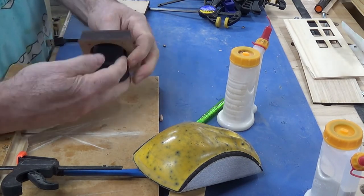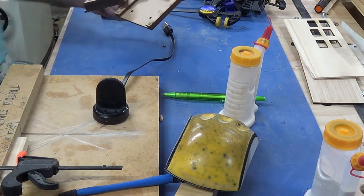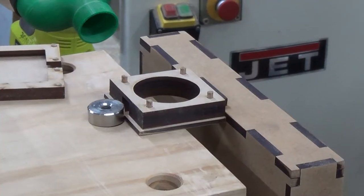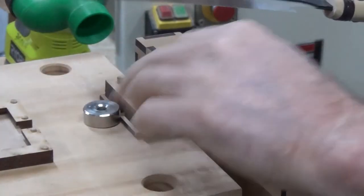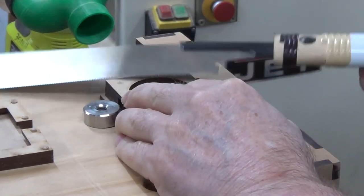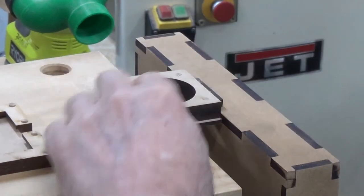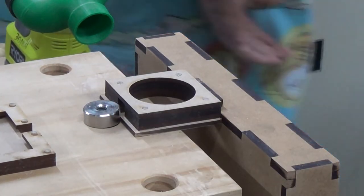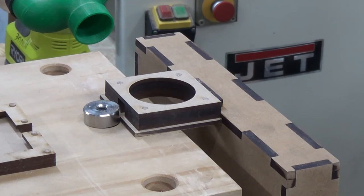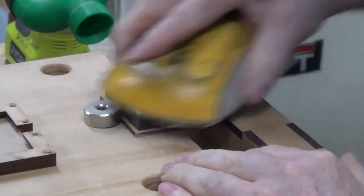Alright, look, we'll go along and I'll set up the camera where I do this work and we'll continue from there. Okay, here I am now removing the little nibs of poking out dowel with a flush cut saw. Nothing magical there. Sand touch up, 180 and 240.